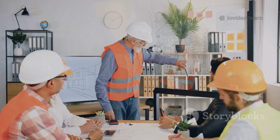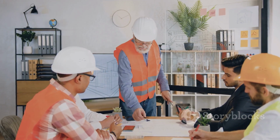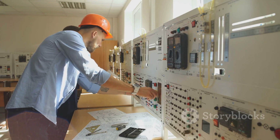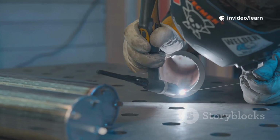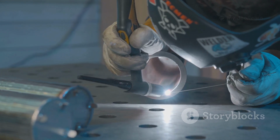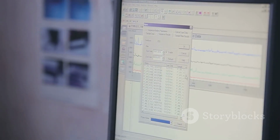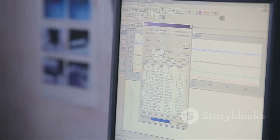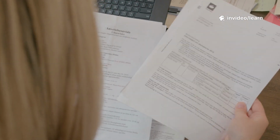The plan is closely linked to your process failure mode and effects analysis, or PFMEA. PFMEA identifies risks. The control plan puts those controls into action. For example, if PFMEA flags a weak weld, your plan includes a specific test to check it. All measurement data is logged, sometimes in Excel, sometimes in a quality database or MES. Accurate, organized data is essential for traceability and PPAP approval.